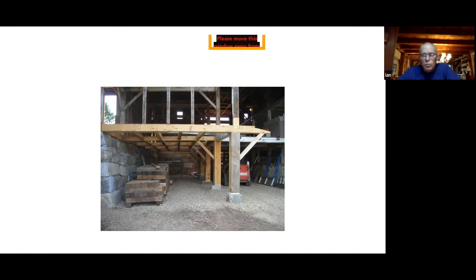Your goal is to maintain the integrity and strength of the timber frame, so where there's new wood going up a post, it can't just be a straight cut — that's not becoming an integral part of that post. You have to do a lap joint, and it can't be a straight lap joint, because even bolted it isn't permanent. We do what we call a locking lap joint. There's a slight bevel on the top cut, and a bevel on the bottom cut, so the next piece has to go on in a straight line and maintains that straight line once it's pegged. If the barn starts moving, that joint fights that movement.